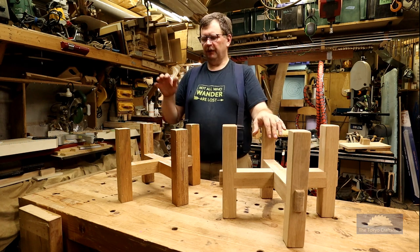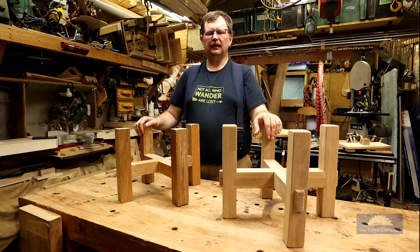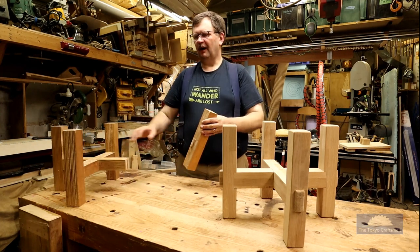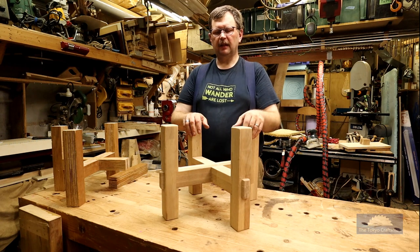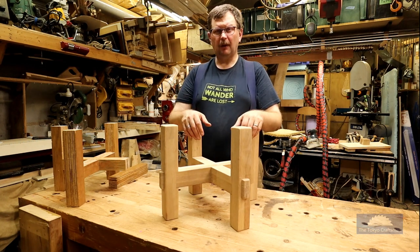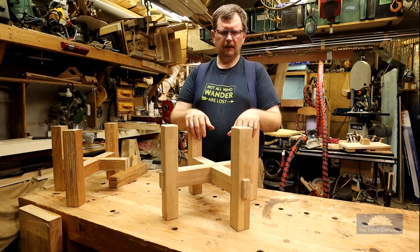Okay, I'm done. This is a huge improvement over the old one. The old one was just three-quarter inch plywood with three-quarter inch plywood joints — it was never intended to last. I only made it because they suddenly needed something to get the usu a little higher off the ground. So it broke, and obviously that wasn't good. This new one is all hardwood — no nails or screws anywhere. There are wedge tenons, and in the middle I put four dowels to hold everything together. It's made out of oak butcher block — in the store they call it Siberian oak — and it's really, really hard.